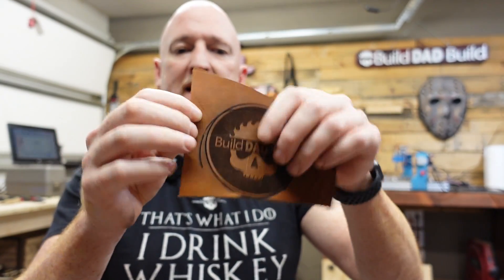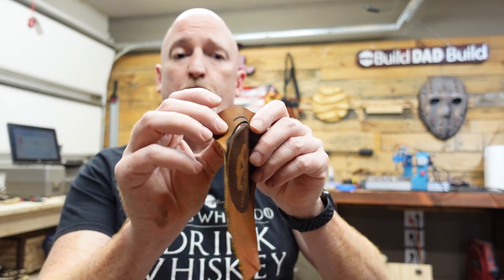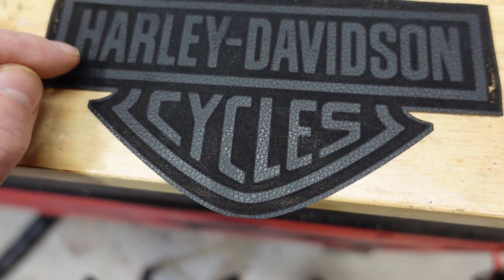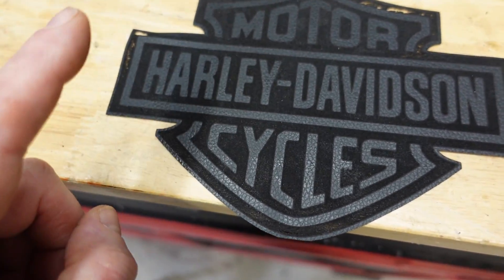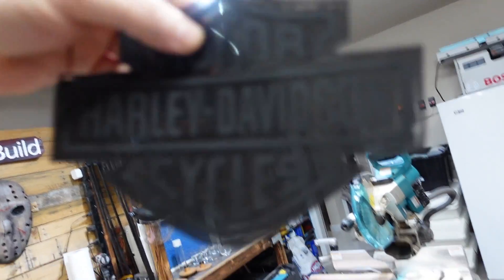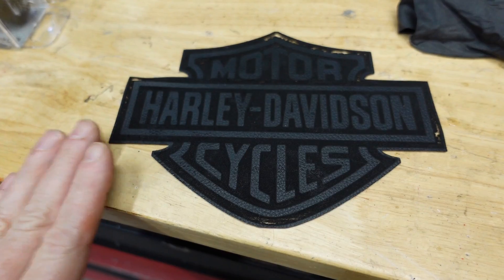Next we can cut and engrave on leather. This is a piece of leather about two millimeters thick. It did start to cut it, though I had a problem with the machine grabbing it and I didn't have it weighted down. It will engrave and cut through about two to two-and-a-half millimeters of leather. They also sent me some thinner black leather — I thought it looked pretty cool. Upon the initial test engrave I cranked the power up too much, which gave it a kind of sheer look that I thought was cool, but it started to fall apart. If I had used their recommended settings it probably would have turned out better.